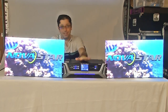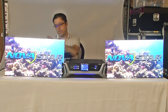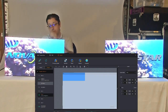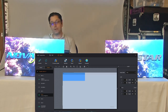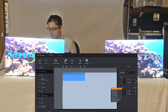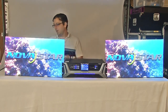The next thing is latency. The latency on this is extremely low. Switching between sources is amazing because you can use this as its own internal switcher with the VCAN software. We have the two laptops connected — I've already brought in the HDMI 2.0 and a DVI input, dragged and dropped them. You can do up to three sources plus one solid background, which is amazing for events using software like Resolume or other VJ and media server programs. Once you have that set up and scaled to your LED wall, it's as simple as sending one image to the back, bringing the other forward — instantaneous, no extra hardware needed.